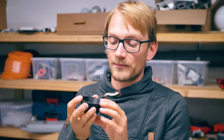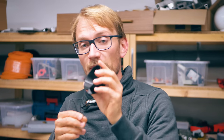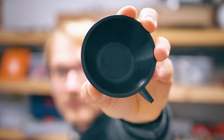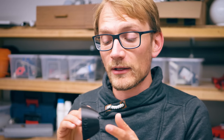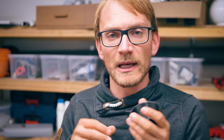This actually came out really nicely — the surfaces are smooth, the bottom did curl up a bit because this was printed at 230 degrees Celsius, this is still a PLA, but it feels good in the hand. The handle could be a bit bigger, but it's alright — it's just an espresso cup, not a coffee cup. If you look inside here, the Hilbert Curve infill actually looks super neat, but I'm still gonna sand it down with some 400–800 grit sandpaper on the inside, just where it's gonna touch the actual coffee. If you're worried about food contact with PLA, you can always take a polyurethane coating — there are special food-safe ones out there — and just coat the entire inside or the entire cup with that.